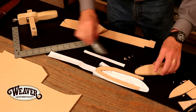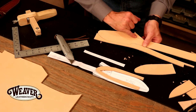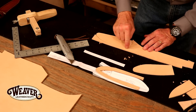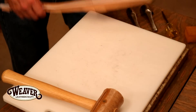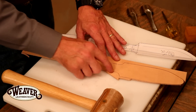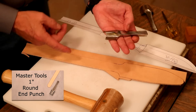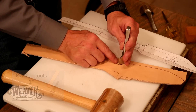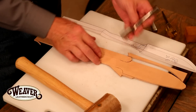On this, we're going to use a punch, so I'll simply cut right down to the top of my round corner. We're going to step over here, drop in a round end punch here, and a round end punch on the end. When you're punching, we don't necessarily have to punch anything here — you can cut these by hand. We've got nice big round corners there, but I'm going to use a round end punch and basically use half of that. I'm going to drop the wing right in my cut line. There we go, and we can trim this off if needed.